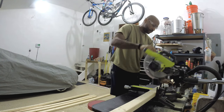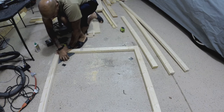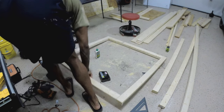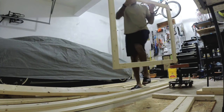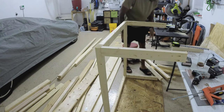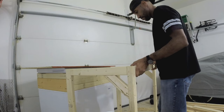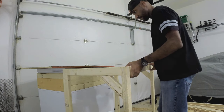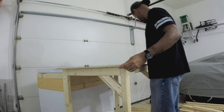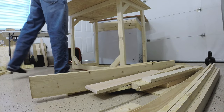I'm making the actual box that the freezer slides into the back of — this is the bulk build of the keezer bar. The simplicity of the design technique I went with is fantastic. All I'm doing is making a giant box that I can slide the freezer into the back of. The keezer bar top sits on top of the door on the collar that I built. This is just a simple frame that I'm going to decorate, trim out, and make it look the way I want it to look. The advantage of this is that it's super easy to do — you just make the frame, decorate it, and then slide the freezer into the back.